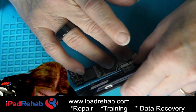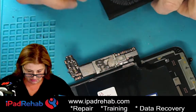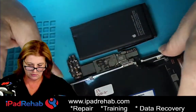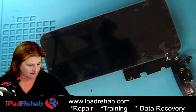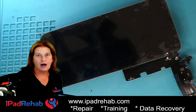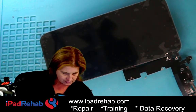There's really nothing visually cracked that I can see — of course I can't see under there. A lot of times with a run-over iPhone 13 the problem is on the bottom board. So if you separate the layers you're good to go. Our hope is that's the case here, in which case the iPhone 13 top board will turn on by itself and we'll be able to ignore the glue. Then the real question: if we get the data, do we take the glue off to put them back together, or just re-glue it?